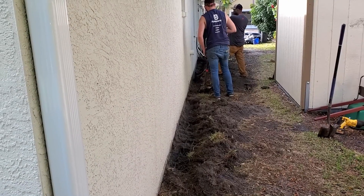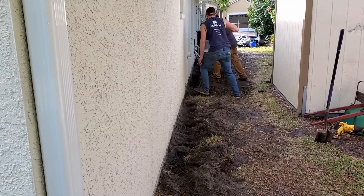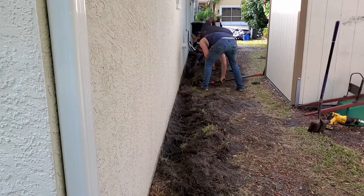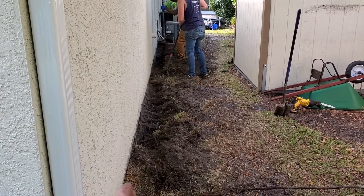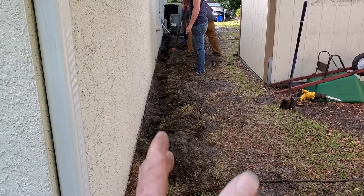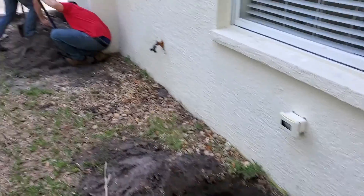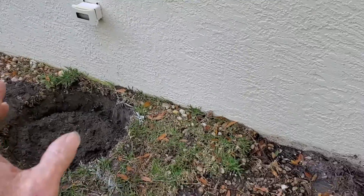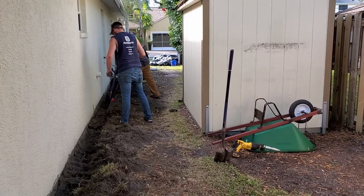We're getting more to the interior of the house. A lot of times we only see it on the outside wall. Inside the house there's a brand new tile floor, and inside each tile where they grouted it, there is efflorescence coming up throughout — even in the interior. So what we need to do is parge — that's what we call it — parge the outside wall. We dig down to the footer, clean off the wall, then install the footer tile. Some people call it a French drain, but we call it a footer tile because it sits at the footer level. We'll trench all along here and it'll come over to our sump basin back in the corner by the lanai. It'll go to a sump pump, which will lift it up and send it all the way out to the front.